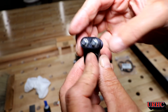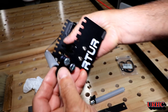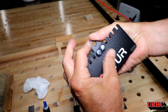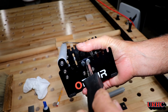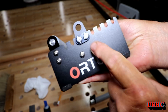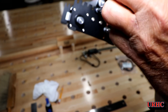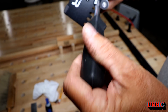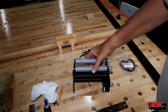It slides down over those slots in the side — one plate stays on the outside and the nut plate goes on the inside. You just push them down so they're all the way to the bottom of those slots, and the rollers come out parallel every time with no nuts to hold. I've got them both in there now — you don't have to worry about holding anything. I just need to find some Phillips head screws to match everything else.